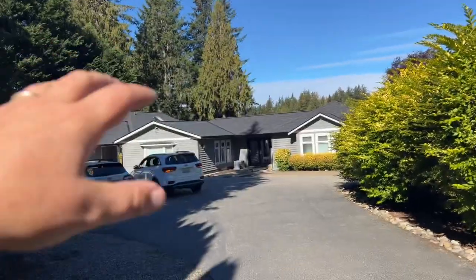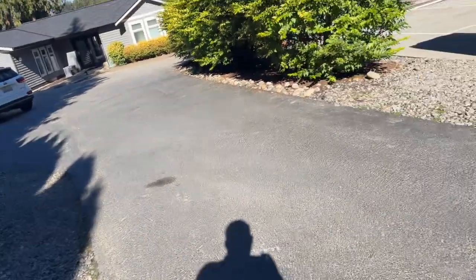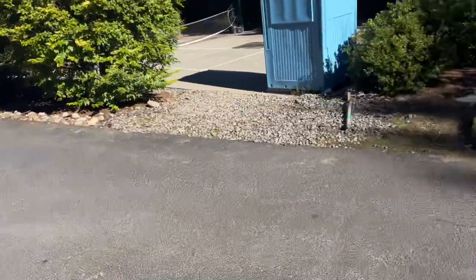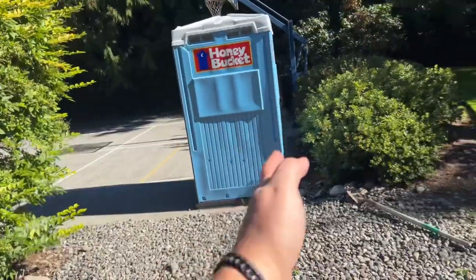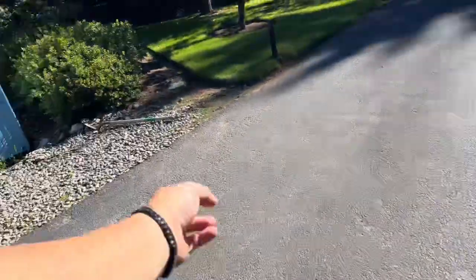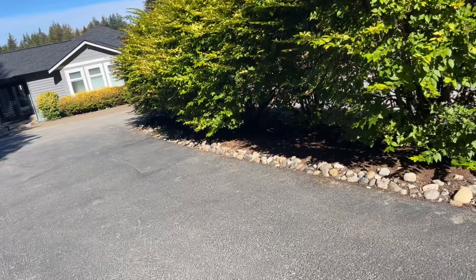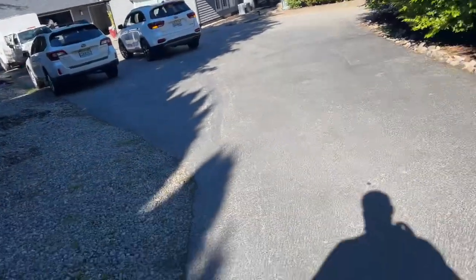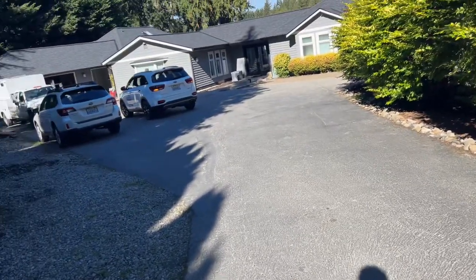They're doing some work on the house and they want to do an overlay on top of this asphalt to make it look good. They had some patchwork done and some crack fill, and they just want it to look really good from the concrete and doing a straight shot over with an overlay. I said 2-inch minimum. I'm going to double check with Wepler if a 1-inch minimum is okay — if so we'll do 1 inch, otherwise 2 inches.